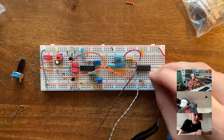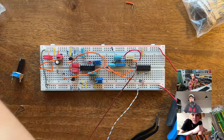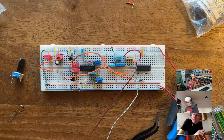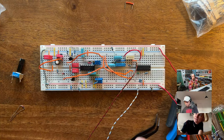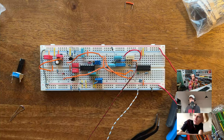But I really like the phase-locked loop 4046. I don't know if you played with it. You can make really cool oscillators. It's a very simple voltage controlled oscillator, a CMOS chip, right? I can make some really interesting sounds with it. Whatever frequency you send to the voltage input, the internal oscillator locks to whatever you're sending to the pin. I was playing with it, and you could almost make kick drum sounds with it. That's really cool. And you can easily add voltage control as well. Yeah, I think I saw a document somewhere where someone made a proper scaling VCO out of the thing.